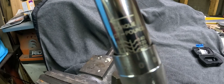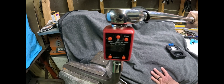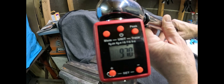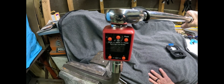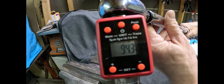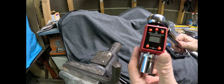Dialed up right to 100 foot-pounds — now we're going to see what happens. Just gradually ease into it, only pulling from the end. It broke at 97 foot-pounds. You saw the indicators telling me I was getting close. That time I broke at 94.3. Let's do one more — that time it's at 96.1. So it looks like I'm about four or five foot-pounds low on my torque wrench.